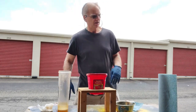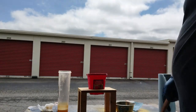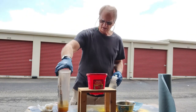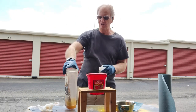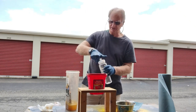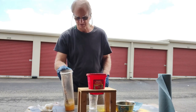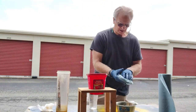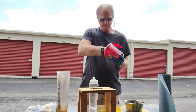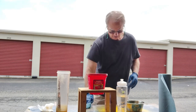I can pour the reclaimed mineral spirits back into the container, put my brush back in, and it comes up just to about the bottom. I want to add a little extra since you lose some during the reclaiming process, so I open up my drinking container and pour in just a little bit. The real beauty is you haven't created a mess whatsoever. I can put the tops back on, use another piece of toweling to wipe out the remaining containers, and wipe off the table.